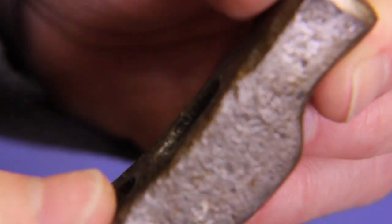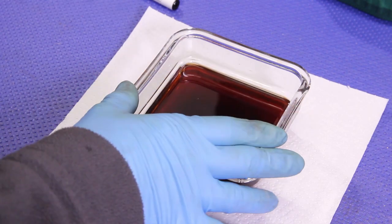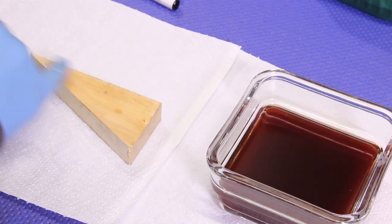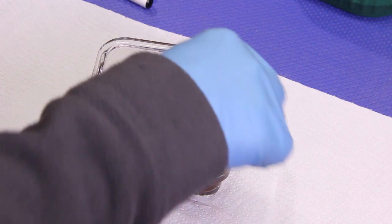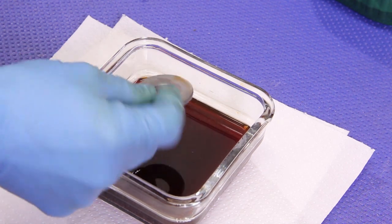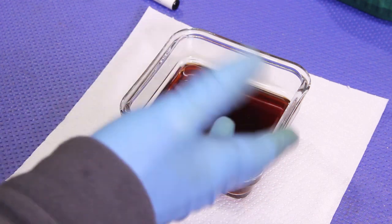Heating further at 250 degrees Celsius for two to three hours would turn the coating into a dark brown-black color and further harden it. What to do with the spent liquid? If the acid is completely spent and saturated with ferric oxide, it could be used as a mordant. This bath is not spent at all, but to give you an idea, it is able to provide a light transparent color when applied to wood. Unspent acid can still be used to treat other metal parts, and it can even be used to remove zinc coating, as in these two washers. Finally, if the acid is not fully spent, you can use it as a weed killer. Just be sure not to exceed a concentration of 20%. The contaminant is just iron acetate, or even zinc acetate if you etched or removed zinc. Acetic acid is not harmful for the environment.